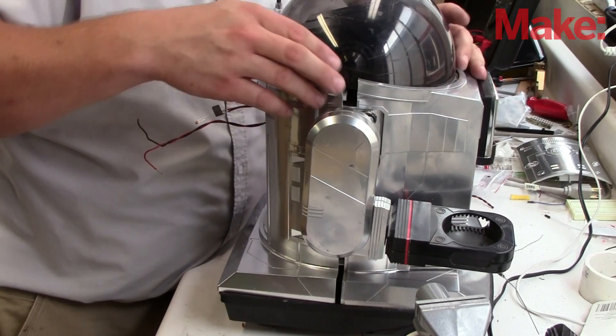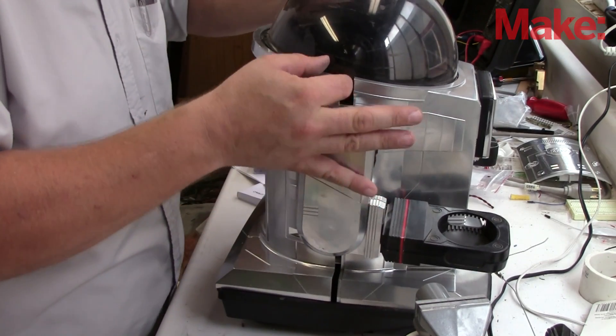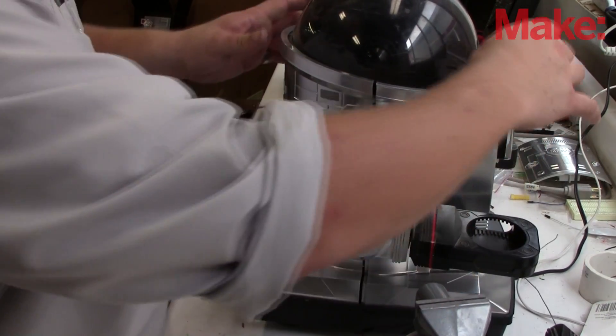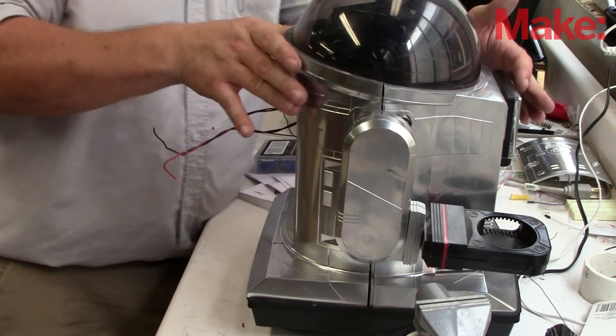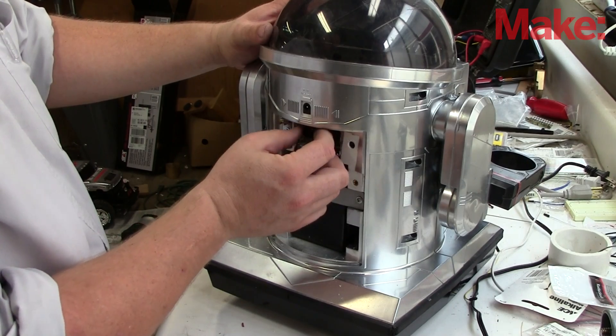I'm really glad that I didn't choose the 7805 and went with the BECs — they'll do a great job at powering the system. Once everything is installed and I'm assured it's working, I clean up the wiring a little bit and then button everything back together. Then I go in and put the plethora of screws back into the body of the robot. From there, it's installing the 12-volt battery into its new home and putting in the final wiring — basically the ON switch.